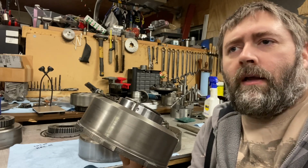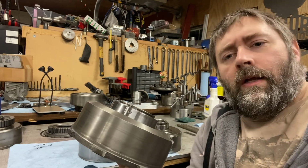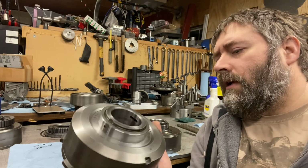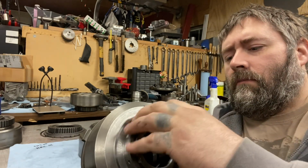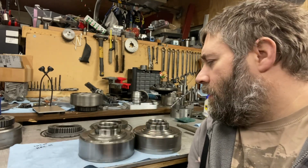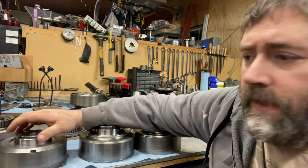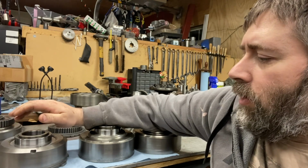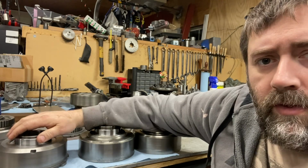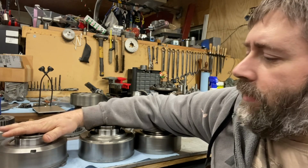So I'm gonna go back, pull it out, and redrill a lube hole for it. And so once you do that, it should be pretty much perfect. I mean, it's same hardness, same smoothness. And as far as the size of it, if you can go a little above 3.5 and then do the sanding to it and then double check it and get it right on 3.5, I think you'll be golden.